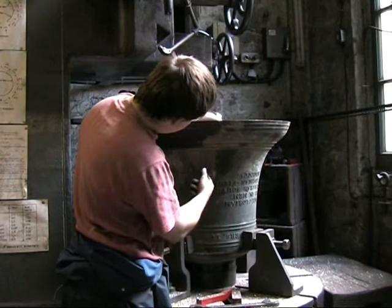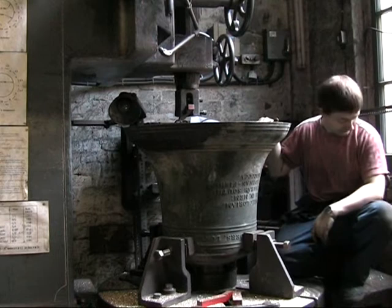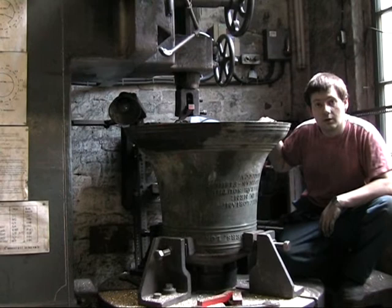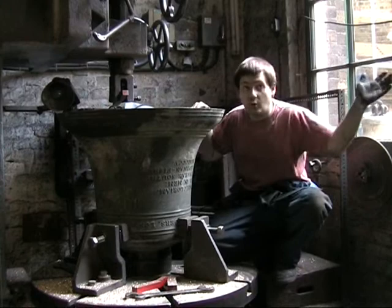And the sound over the strike note. As you've got the bell facing upwards, the top part affects the strike. The middle section affects the hum. And the bottom bit is the second partial. That's the one that should be the same as half the nominal, but isn't necessarily. That's just a general rule of thumb. I mean, you take metal off anywhere, and all five frequencies move.